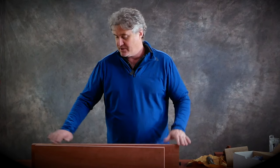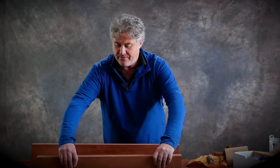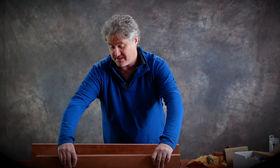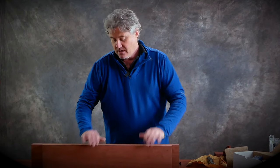One interesting little quirk about the material once you've cut it out is you'll see that the front vise section is about 4 millimeters higher than the rear vise section. The reason for this is because it gives you a reference point when you're setting the Moxon Vise up on your bench, so you just push it against it and clamp it down. But we'll cover that more as we build the vise. Now, let's have a look at laying out the positions where we're gonna bore our holes.